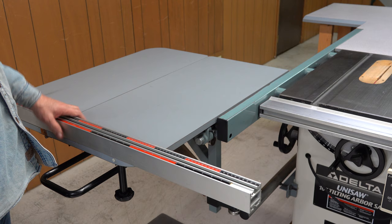Number 38, push sticks. Now these are just out of masonite, real thin masonite. These are for doing obviously really thin pieces, you know. And the only commonality to each one of these is that they all have sandpaper on the bottom of them. And then we have one giant one over here for really big stuff, and that's got a removable heel on it. So you can do what you want for thickness back here. I mean, if you're always doing thick stuff, to have a thicker heel back here is a good idea. But I do a lot of thin stuff, so I can't. And there you go, push sticks, number 38.